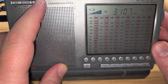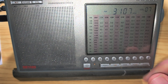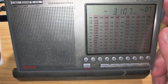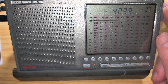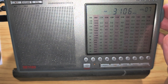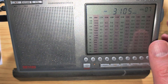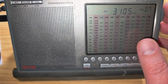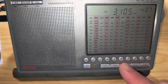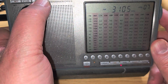You might wonder why this happened — this radio is divided into bands that are pre-programmed, so when you tune around you actually jump into these band plans. You can see the needle at the bottom; it will jump from one to the other. You have to manually tune a frequency outside of it if you want to continue tuning where you were. And of course here it removes single sideband — we'll put it back so we can tune and continue.